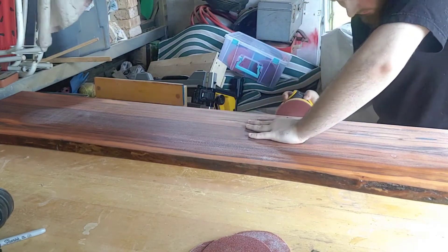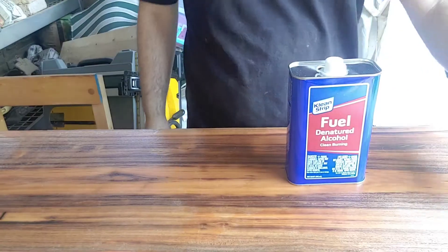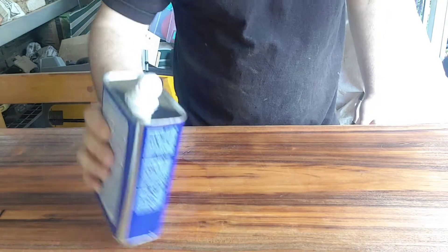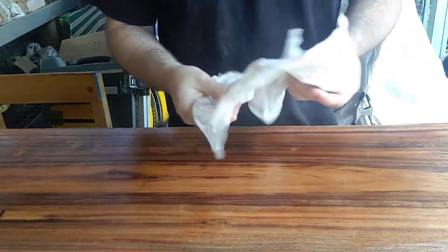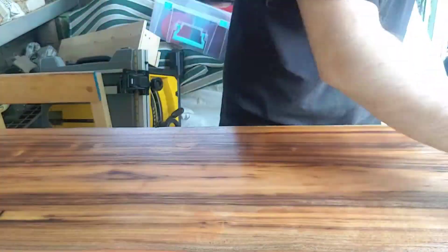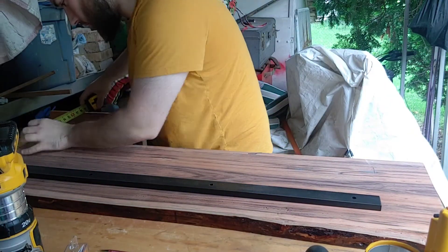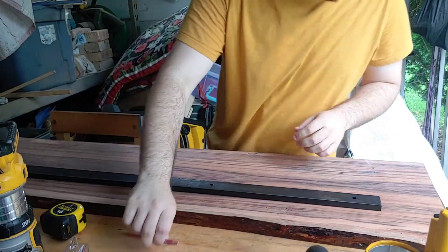It's really a passion more than anything — I'm not really making any money off of this woodworking, it's more for fun. I realized that I can just dilute the shellac with denatured alcohol rather than sanding it all off — it goes a little quicker. I cover everything with shellac so it doesn't warp overnight with the moisture content. Here I am putting some C-channel in so that long term my project doesn't warp over time. It's just precautionary for seasonal wood movement.